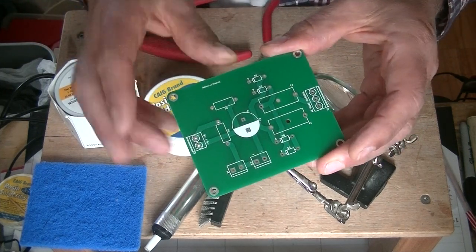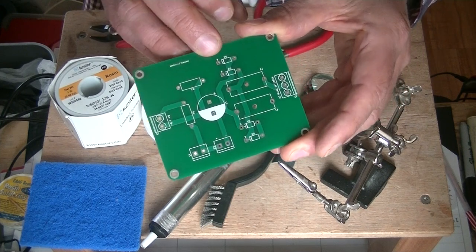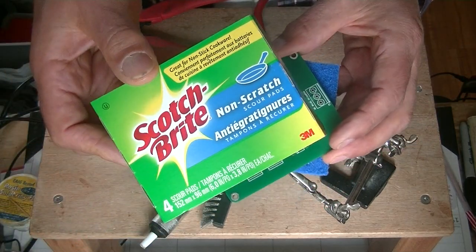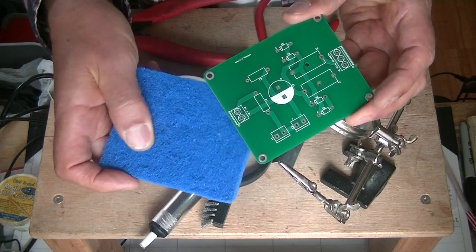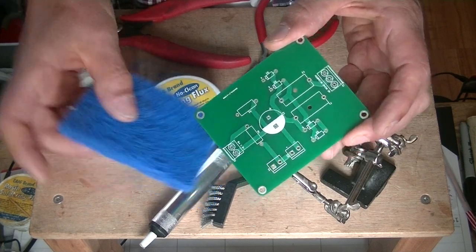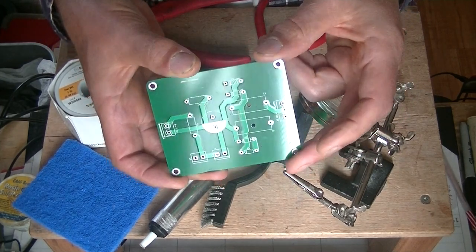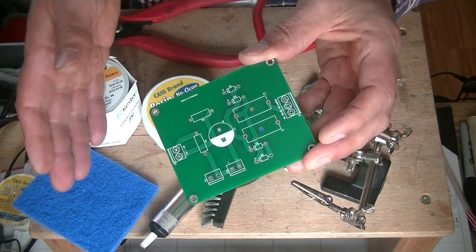What if you're working on a circuit board? Generally speaking, they come with a clean surface from the factory, but there's something that's always residual on the pads. What I do is get a 3M Scotch-Brite blue scrubby — not a cheap dollar store thing. This is the perfect grade: just coarse enough to get the surface cleaned up without scratching the board. I take the new board, put a little bit of soap on the pad, put it right underneath the kitchen faucet, and scrub it under soap and water. Rinse it off thoroughly, wipe it off, and let it dry. Do not start soldering on a wet board.